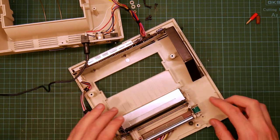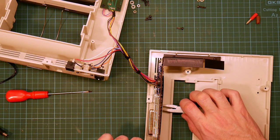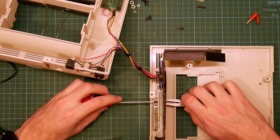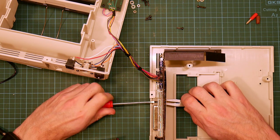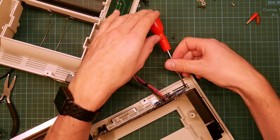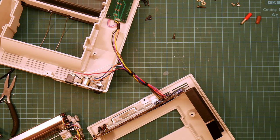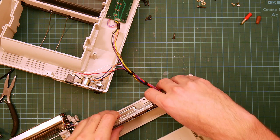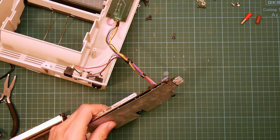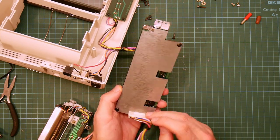That's actually a little bit problematic because I was hoping to compare the signals from the two to verify what was going on. It does suggest that the stepper motor is getting the right waveforms from the controllers, just not at a high enough voltage. So this suggests that the power supply to the stepper motors may be failing. And it's been slowly degrading over time — the paper feed stepper motor needs more torque than the stepper motor that runs the printhead, which is why that continued to work for a bit.